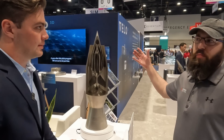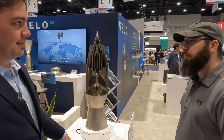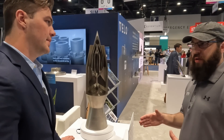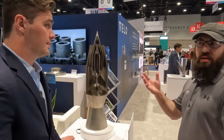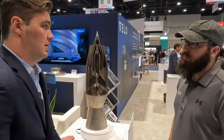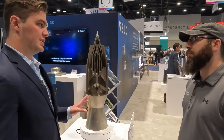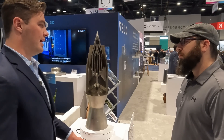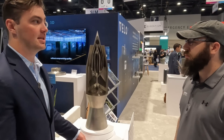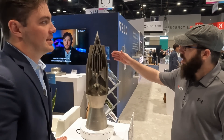So this was the one-meter-Z size machine — how big can Velo go? Our largest platform is the Sapphire XC1MZ — a 600 millimeter diameter build plate that you can extrude to a full meter in Z, and it's a circular build volume. Why cylindrical versus square? A lot of people in the industry print on square or rectangular build plates, but when we first started talking to customers, they were very interested in printing rotating components and things that were more circular — pump housings, things like that — which pointed us toward a circular build plate.